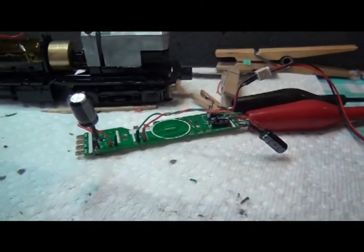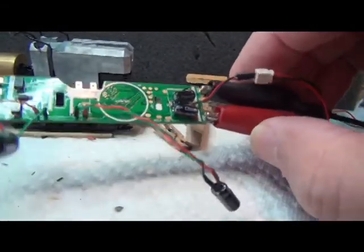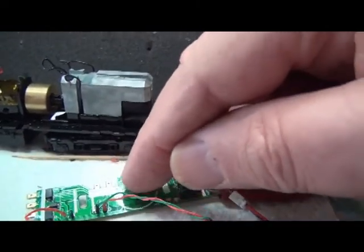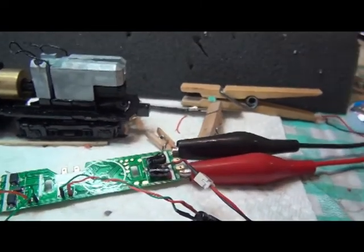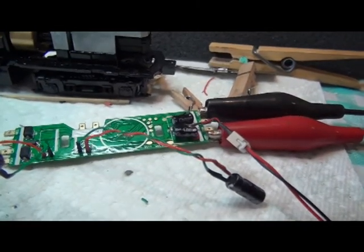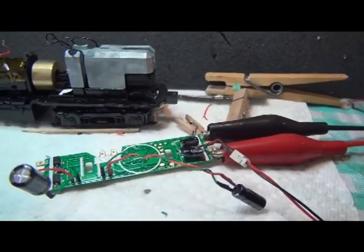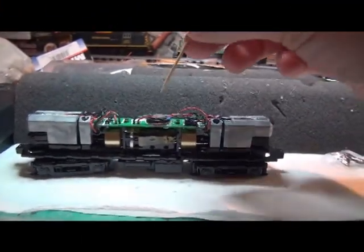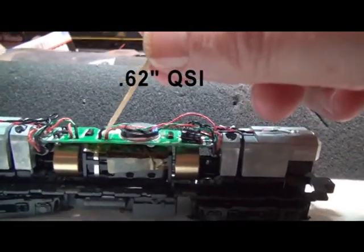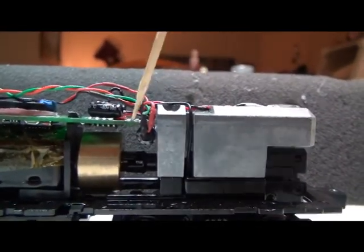I have videos out with that different decoder, but I do like the 1622s and I don't mind going to this trouble to use them. They fit in, they don't take a lot of space, and I can install a speaker right here — a 0.62-inch diameter, almost three-quarter inch, but just a little bit too large, so instead of a 20mm I use an 18mm. I've got the speaker mounted on top of the board where the capacitors were, wired directly to the board, and tucked them underneath on both ends. They take the place of the originals, which were too tall to close the cap.